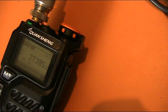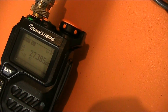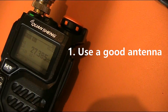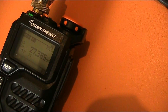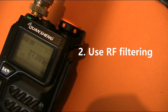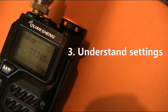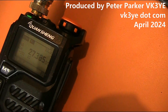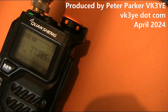I've gone through three tips to help you get the best HF reception from the Quansheng UVK5. In summary: use a good antenna — either a wire as long and tall as possible, or a magnetic loop. Secondly, use filtering — bandpass or lowpass filtering appropriate for the frequency you wish to monitor. And thirdly, get to know your radio, notably settings such as gain and bandwidth. Once aware of all those, you'll get better than expected results with this amazing little transceiver.